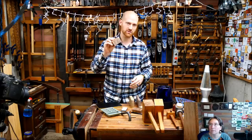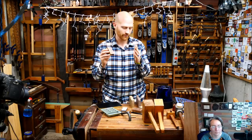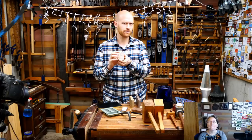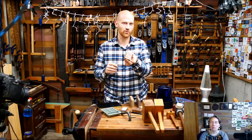It's actually a good way of dating furniture, because you'll see these on the side. It's also known as the, total mind blank, Knapp, K-N-A-P-P, the Knapp joint, because Charles Knapp, Chris Knapp, something like that, patented this joint. He actually did it in Waterloo, Wisconsin, just a little bit north of me here. Kind of a cool thing. But then they figured out how to do traditional dovetails with a power tool, and this disappeared suddenly.